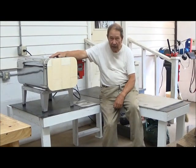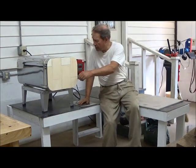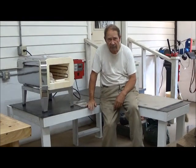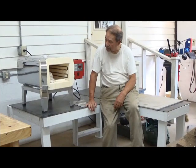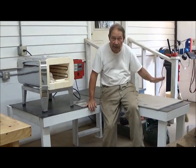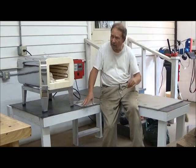This is our tempering oven. It runs up to nearly 2,000 degrees, although you don't usually run it at that temperature. The knives go inside and they get heated to something between an orange and a white heat, usually. They are wrapped in stainless steel foil with a little piece of paper to soak up the oxygen so they don't scale that badly. These stainless steel knives, very, very hard indeed, are put on this flat aluminum plate when they come out of the oven, and another piece of aluminum is put on top of them to keep the knives from warping whilst they cool. Otherwise, particularly the longer blades will tend to take some sort of twist or bend, which you really don't want to have happen in your knives.